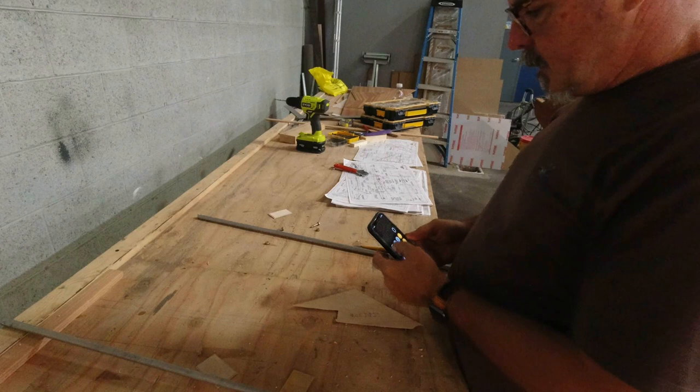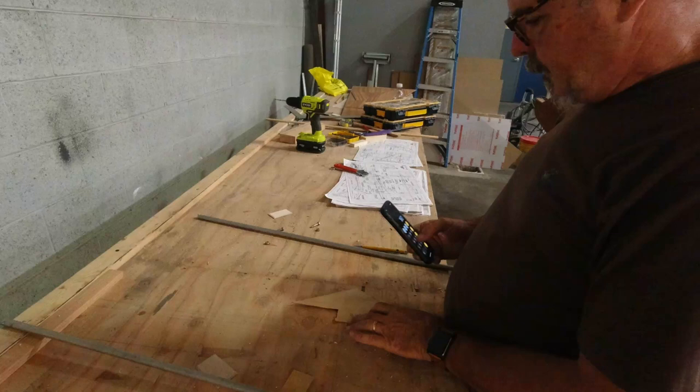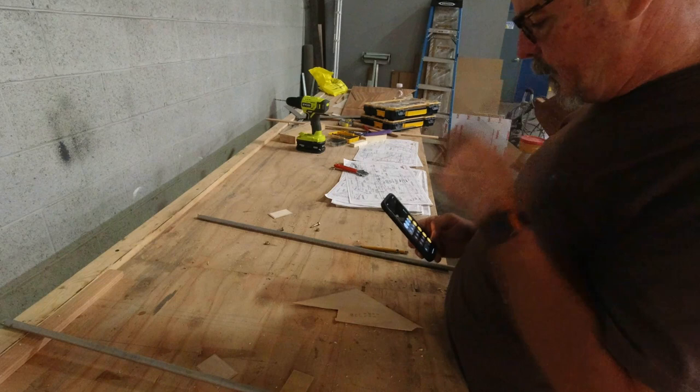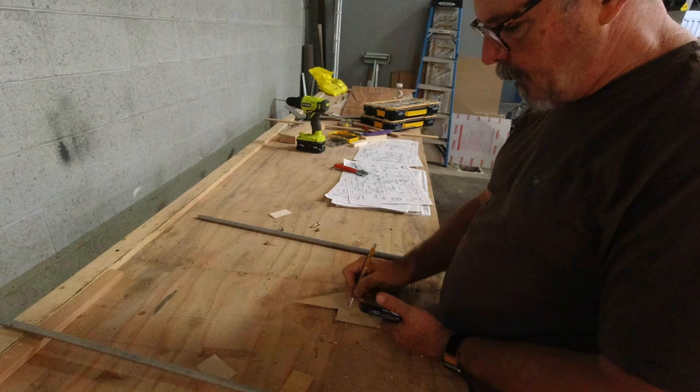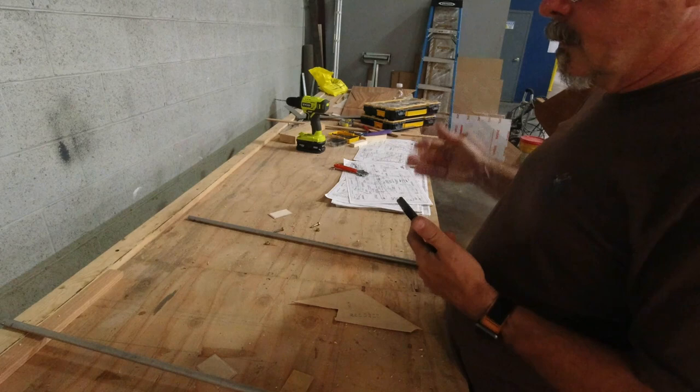All right, so that's all the components as they stand right now. And let's see what we got here. We got 86 plus 37 plus 37 plus 4.4 plus 2.0 plus 3 plus 1. So that's 170 pounds for the airframe right now, 170.4. I think our engine is going to weigh 89 by the time you put tubing and everything else up there. Let's just call it 90 pounds. So I've got 90 pounds of engine.